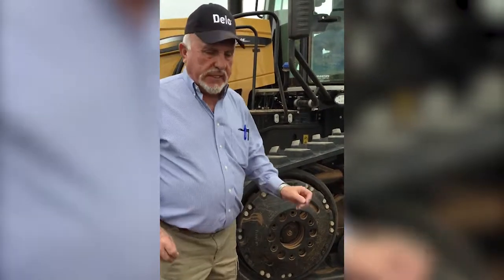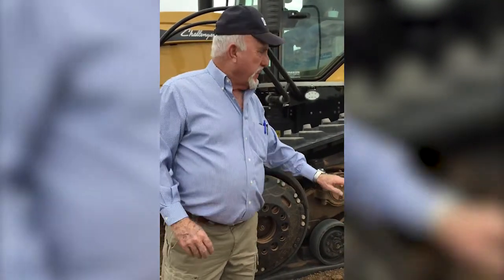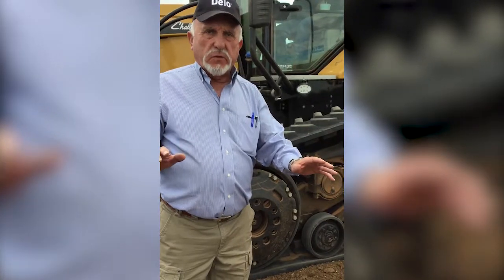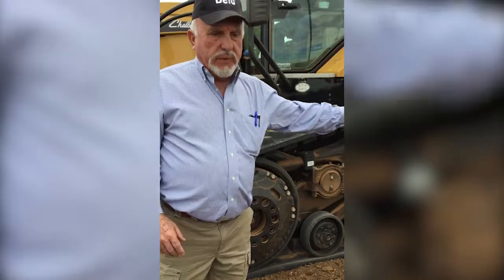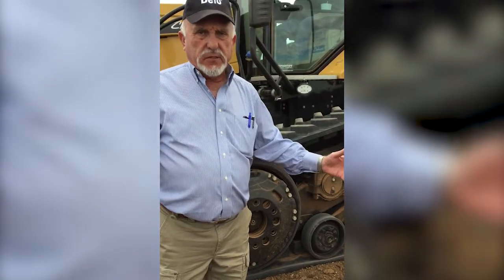They tell us that we can take an egg and put it 2 inches below the soil surface and the track machine will not break the egg. And so a track machine has a real advantage in this kind of application when we're putting high horsepower loads to pull a parabolic deep ripper that will open up the porosity of the soil.